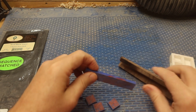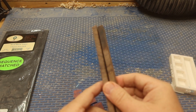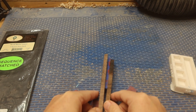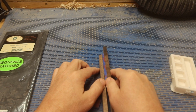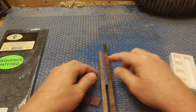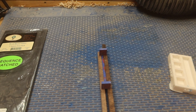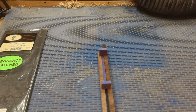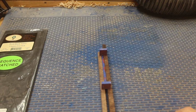So today I'm going to use this, so we'll have this down the middle of our pen blank with the walnut on each side, and then we'll cut this to length. I'll pick out a nice part of this walnut. We'll cut that to length, and then we'll segment onto it each end one of those little segments. We won't need all four of them, so I'll save those for later. We'll segment those onto the end and then cap that with another piece of walnut on each end.